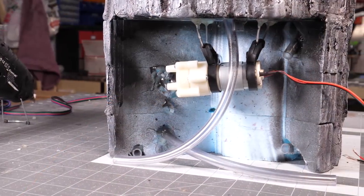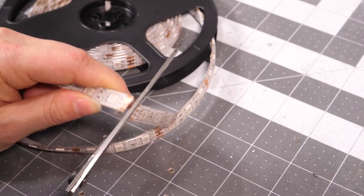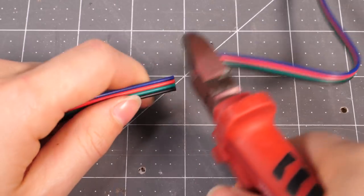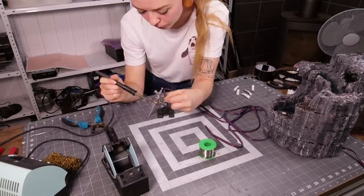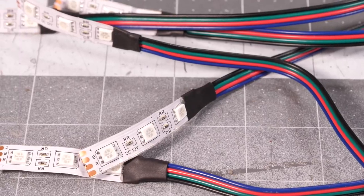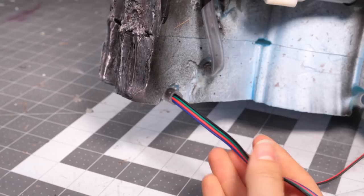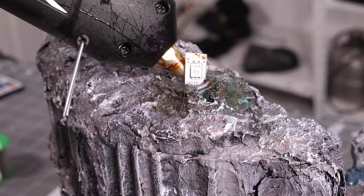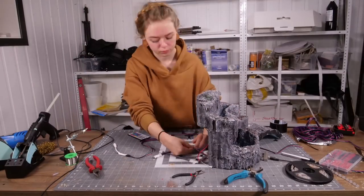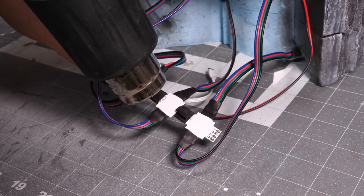At this point, the only RGB LED strip I had was a waterproof version, so that's what I'll use, but ideally you'll just have a regular RGB LED strip. It wasn't really an issue to me though, as I just peeled off the silicone protection. I cut the six lengths I needed, soldered on a length of RGB wire to each of them, and protected it with heat shrink. Now we have six of these. Because of the tube shafts we made earlier, it was super easy to insert all the LEDs and fix them in place with hot glue. Then I simply had to solder those wires to the RGB junctions on the controller, and connect that and the pump to the 12V power input. You can find all the materials and all the details in the description.